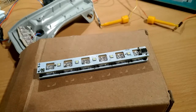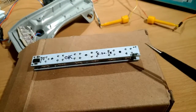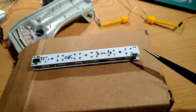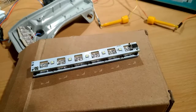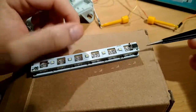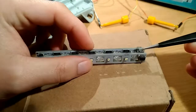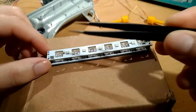One important thing: this small glass tube is what triggers the learning mechanism, and you want to be very careful not to break it. Also, you don't want to solder anything near the microcontroller — the ATtiny. Everything that you have to solder is right there in the designated area.